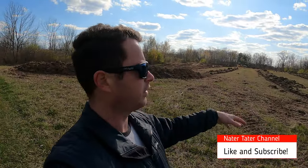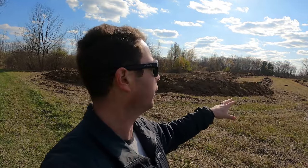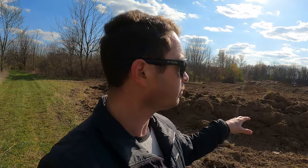All right, so this is about a 3-acre field, and obviously it had a slight roll to it, but not much elevation change. So that's where you can see he's going to kind of terraform this and get it to where I want it. The other note is this is very much clay soil, which is actually very good for an off-road track because it really holds, and if you're a dirt biker, it would bite and give you that grip. But the downside is it doesn't drain very well.